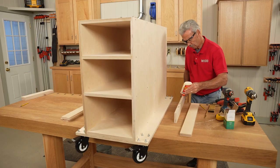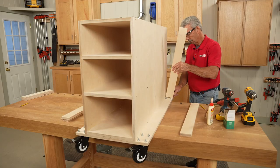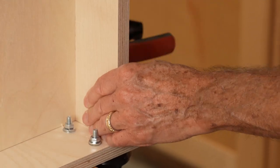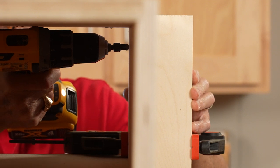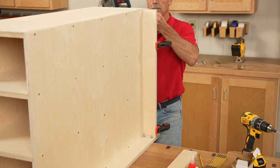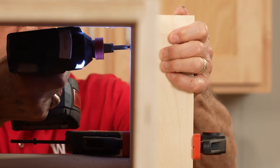I flipped the cabinet over and placed it on the workbench. I'm now placing the first of four ribs — they fit flush to the base, even on top, and set in 2 inches from the outside edge. Using my pre-drilled holes, I'll use a countersink bit to recess inch-and-a-half screws to attach that rib. I'll repeat the same process for the final three ribs.